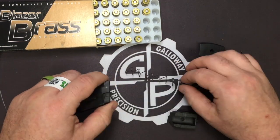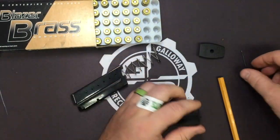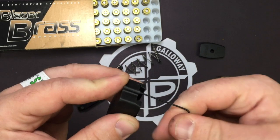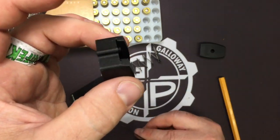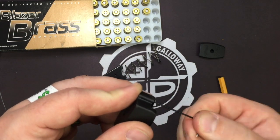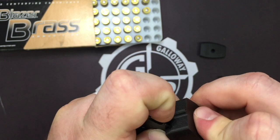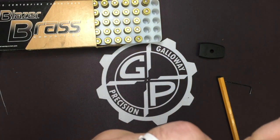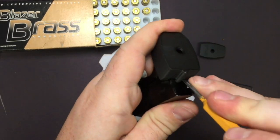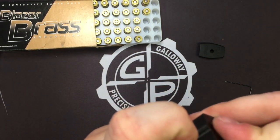I'm going to put that all back in there. Now, before we compress our locking plate, take your 0.050 Allen wrench — these are going to ship with the set screw that holds it in place on the mag with about two or three threads out. Go ahead and turn it clockwise until it's flush, and then we're going to compress our locking plate. The locking plate on these is tricky, so when you first get it on, you may have to take your one-eighth-inch punch and play with it a little bit, because it has a tendency to want to tilt back when you first get going.